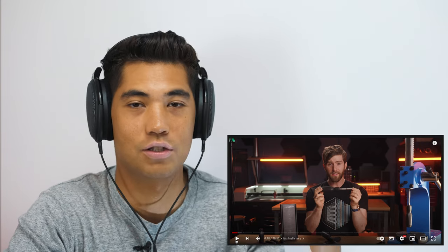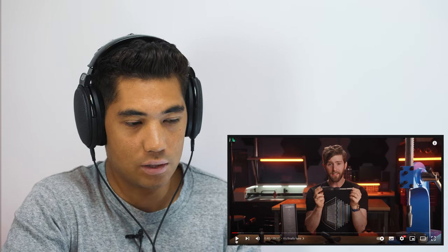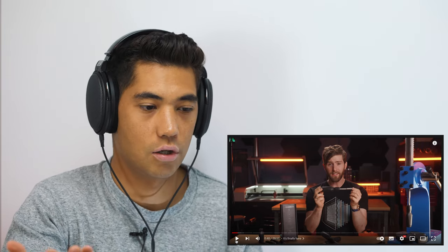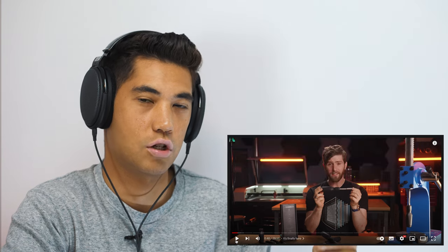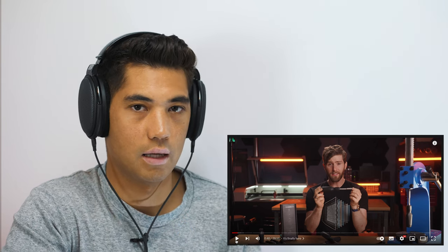The first point I see here: how does it cost $300,000 to make a screwdriver? I can tell you right off the bat, this is the thing that turns away most of the people who come to us wanting to invent something. We tell them that an injection mold is $100,000, and it takes a long time to perfect — not because it's hard to make the mold, but to perfect the product within that mold, because once you make it you can't change it.